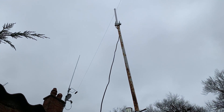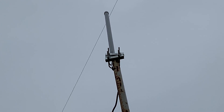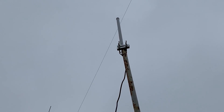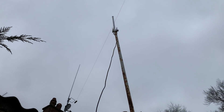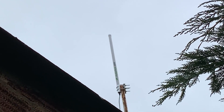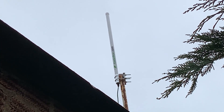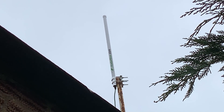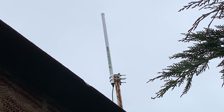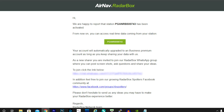The antenna comes attached with around 30 feet of coax, so I was able to mount the antenna on a 3-meter pole which is attached to a bracket near the roofline of my shed, making the antenna height around 6 meters off the ground. Ideally this antenna should be mounted on top of the house so it has a clear 360-degree view with no obstructions, which will obviously maximize your reception range.